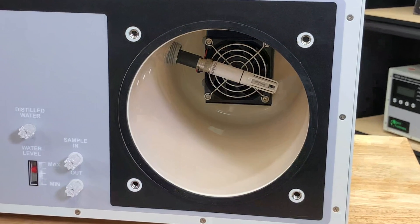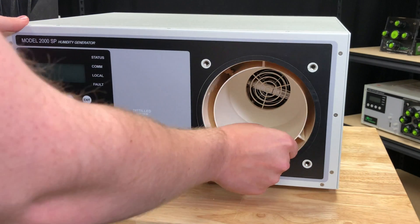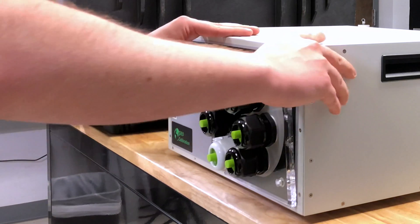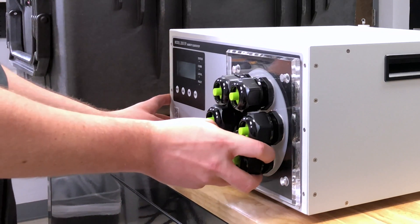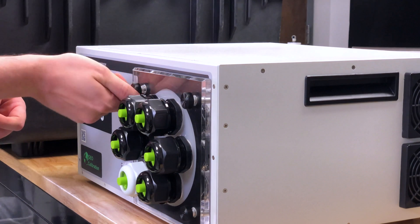Inspect the chamber to ensure that you have a control probe in the rear and a stability insert seated in an upside down Y configuration. Next, take the door and place the bottom edge of the circular seal into the chamber. Then, applying firm pressure to the door face, press the door into the chamber until it is flush against the sheet metal. Now, secure the door at each corner using the provided door screws.